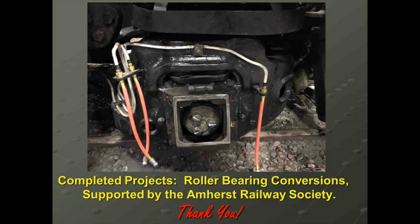We send the axle out to a shop in Pennsylvania where the bearing was pressed on, and then our machine shop in Owasso modified the journal pockets to accept the new bearing diameter. So we thank you for that. And then also you see some new lube lines and other things that were installed. Since that, we've also completed the trailing truck of the locomotive and both tender trucks. So we've eliminated all of the journal oil and plain bearings now.